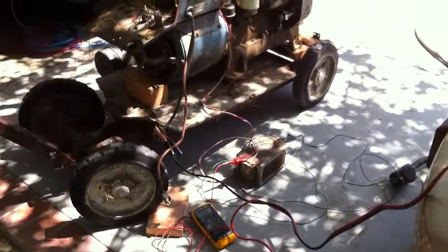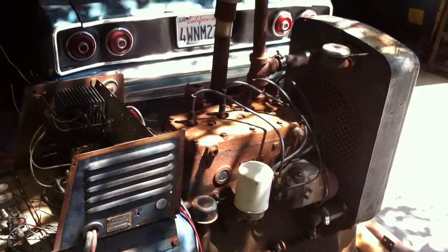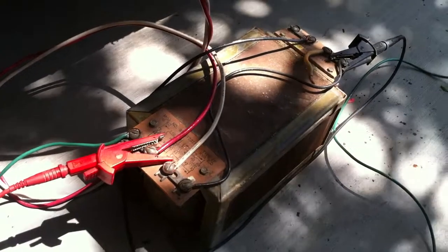Here's an overview of today's experiment with the six and a half kilowatt Kohler. It is 120 volt only, two wire. This transformer is a 2 kVA transformer, but it's connected as an auto transformer, so its capacity is 4 kVA, stepping up to 240 volts.